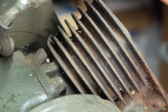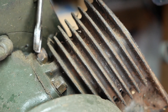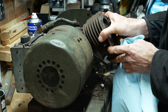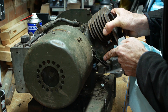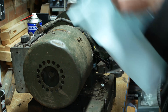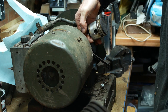Now onto the bolts securing the cylinder barrel in place — some of these are pretty difficult to access. I think removing the flywheel and magneto backplate would have eased this process somewhat, but anyway, I eventually got them all out. Next is to carefully remove the cylinder, remembering to support the piston and conrod, which will flop down as they exit the bore. I've got some clean cloth ready to protect the piston once it's out. It's worth taking your time, because on some engines the cylinder can suddenly free up and the piston can crash into something, causing damage in the process. And that's it safely disassembled.